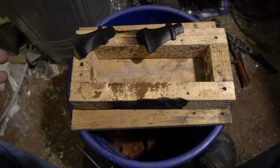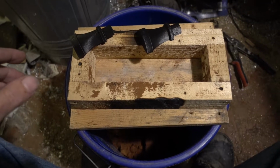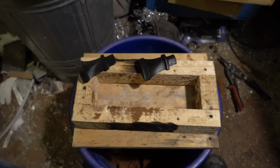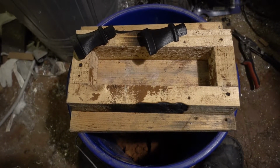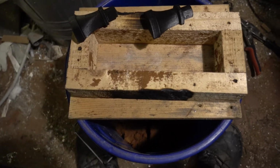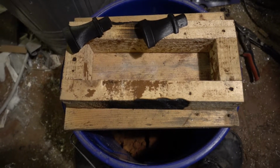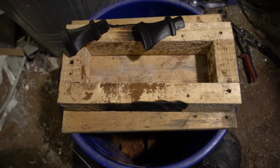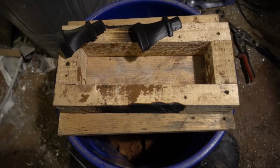I will go for 11% aluminium. So I'm a little bit in the harder, more brittle range of that alloy. Aluminium-bronze, by the way, is a really nice material. You can fine-tune it from an extremely malleable and corrosion-resistant material that you can use for sheet metal work outside, or anything like making wires, for example, or decorative stuff. It's rich yellow golden and extremely corrosion resistant. It stays shiny and golden even outside.